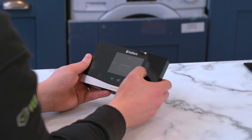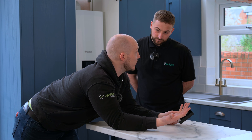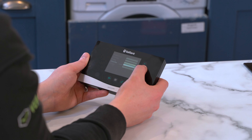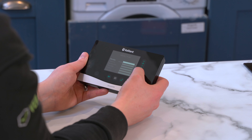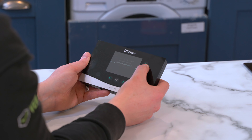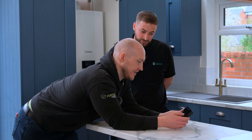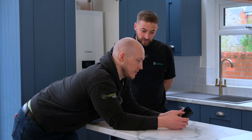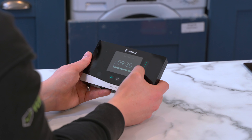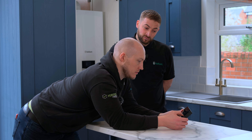We're going to the control, press the tick, and then go down to your zone, which is your heating. Then if you go to your weekly planner, you've got your days of the week. That currently shows you the block in which it is operating. So it'll give you the start time and the end time. If you select the day that you want to make a change to, then you can add a time period or modify one that's already in place. Yours is on from 6 till 10 at night at 14 degrees, which basically means that it's off. If you want to modify that, it will give you your start time. You can change that by scrolling — you can tap it, or if you try holding it, it'll scroll through as well.